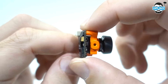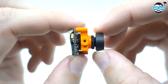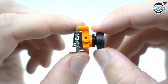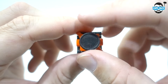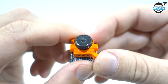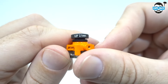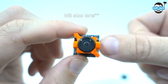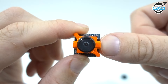Also on the rear, Runcam have placed a slab of plastic, which will help stop shorts. However, on the sides and on the front you can get access to the power distribution board and components, so you may want to cover those over with a bit of silicone if you're flying in wet conditions. The camera comes with a 2.1mm lens, and there's no mention of whether it will come with other lens options. In fact, there's no mention of this camera even existing on Runcam's website, so I can't be sure if 2.3 or 2.5 lenses will also be available. The lens appears to be specific to the Swift Micro and probably won't be interchangeable with lenses from normal Runcam Swifts or HS1177-type cameras.